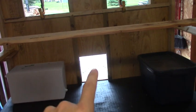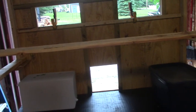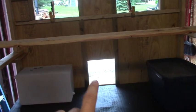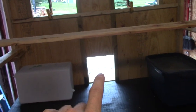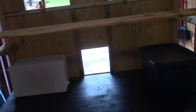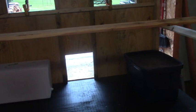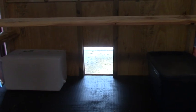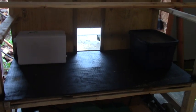You can see I've got the door cut and two windows — those are going to get screened over and just be open all the time. It's not a winter coop, so I don't need to put in glass. I've got this prepared for a movable door, but I'm not going to put that in right now — that can be at a later date. I did cut the opening the correct size for it and left some gaps around the edges so a piece of plywood can fit in there and slide up and down. Alright, I'm going to start putting this together.